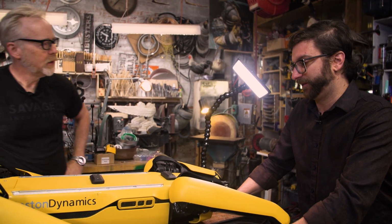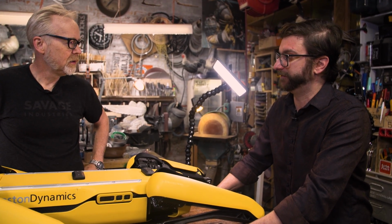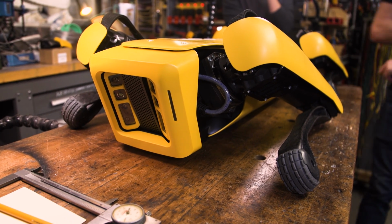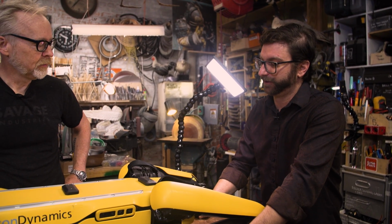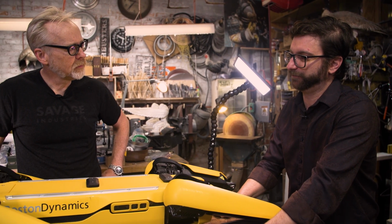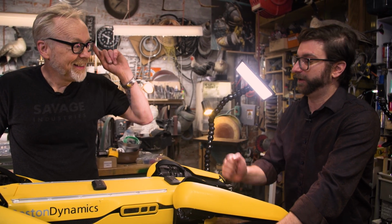One last thing that you may want to think about is that the robot performs a lot better if it understands the forces that are being applied to it. So we have a way in the software of the robot to tell it about the weight being put down on its back. So the weight of a payload, the weight of the hitch that you're going to build. The other thing that might be a little bit trickier, and your team might have to do a little bit of work in software, is the force when the robot starts pulling the rickshaw to start moving, or the force the rickshaw is going to put on the robot when it stops.